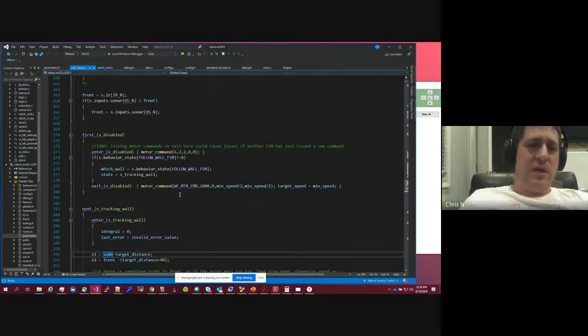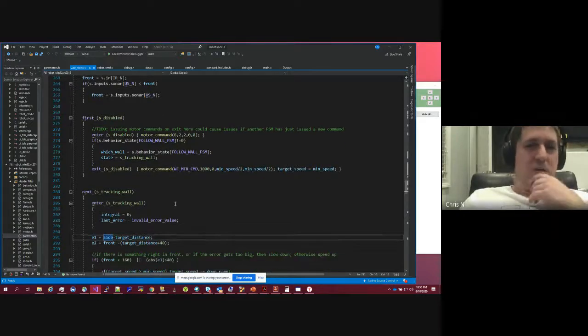And mind you, this is before I did Raspberry Pi stuff. So this runs on an Atmel, an Arduino type of micro, right? So there are no configuration files that this platform has access to. This is all running on an 8-bit micro, and it's talking back to the PC over Bluetooth, like I was saying. And there is a bunch of stuff happening in the background constantly.